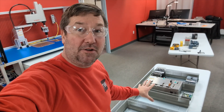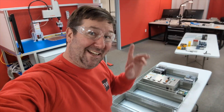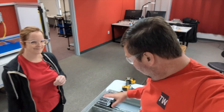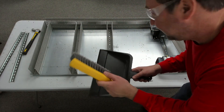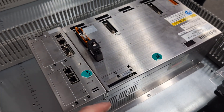Now I have all the components back that are not DIN-rail mounted, and I'm going to figure out the length for my DIN rails. Once you have those cut, lay everything else out, mark it, and go ahead and bolt it and torque it down. According to UL, you probably only need a screw at both ends — two fastening points — but use common sense; you probably need at least a third screw. Notice these black marks are very close to this wire duct, and look what that's actually doing to the wire duct. There's a chance I could pull off drilling these without breaking it, but take an extra few minutes and just take this piece out to make sure you get it right.